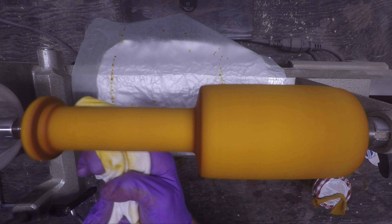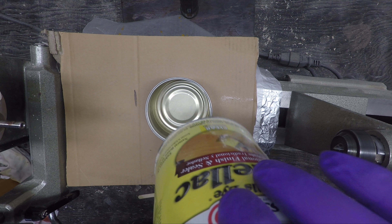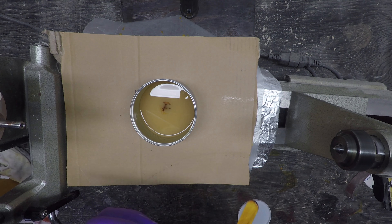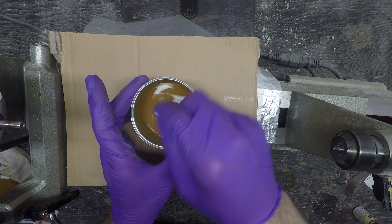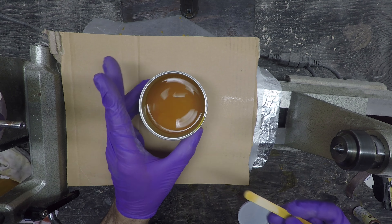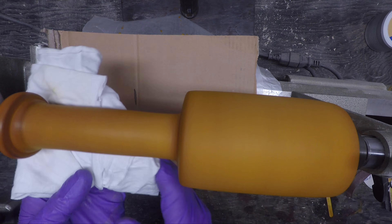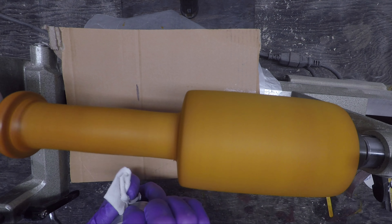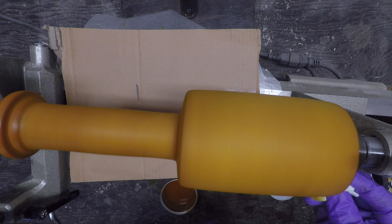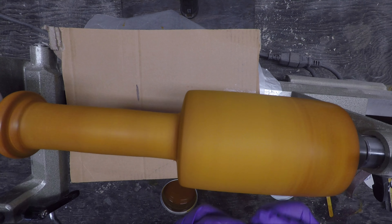I wasn't really too concerned over the finish. But it's been very humid in Wisconsin for the summer of 2018, and I did start having some troubles with the shellac just because it is so humid. I did seal this with the shellac. So I poured about 2 ounces of the shellac into a separate container. I ended up adding 2 drops of the Keda dye amber liquid yellow and I'm just mixing that in good. It's just going to be a slight tint. If I put that on a raw wood, it would have just a very slight yellowing color — it would hardly even show up. But it would have just a very slight yellowing effect. You probably don't need to add the liquid dye to this — you'd be just fine. It would be a very similar color representation and depth with just the powder dyes itself. But I just wanted to add a little bit extra because of the sentimental value that this piece had.